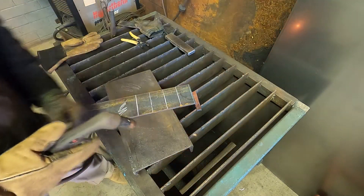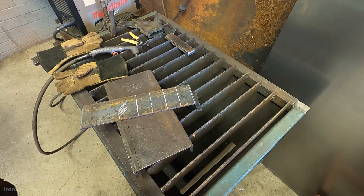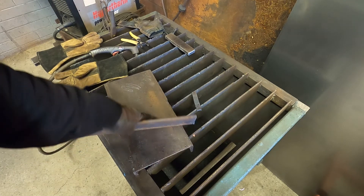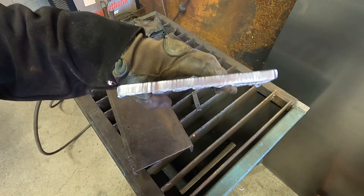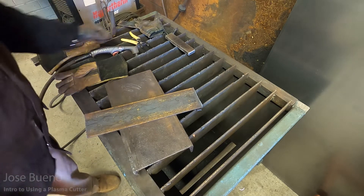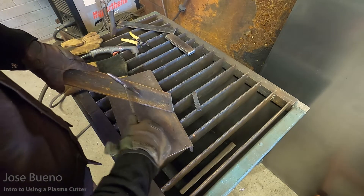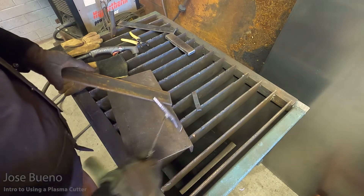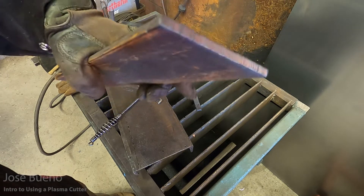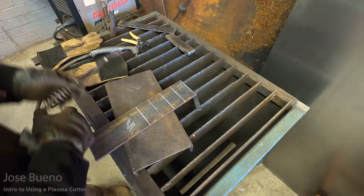As I'm cutting using the plasma cutter, all I'm doing is holding the torch straight up and down, and just dragging it across the surface of the plate nice and slow at a consistent speed, trying to keep my hand as stable as possible — because trust me, if there's any wiggle to your cut, you're going to be able to see it. As long as you're making good quality cuts, the pieces should just fall off the edge when your cut is complete. If they end up sticking, that probably means your amperage was too low or your travel speed was too slow, causing some fusion on the underside of the cut.